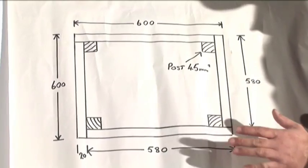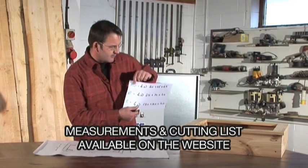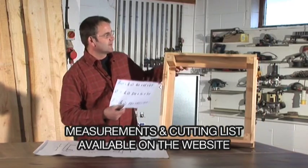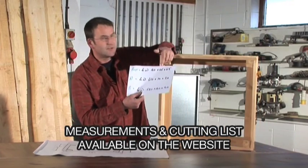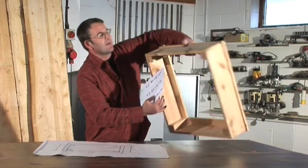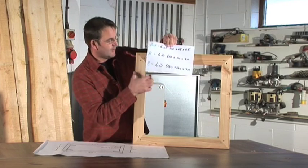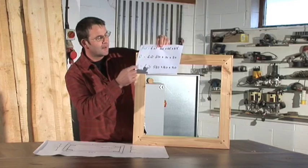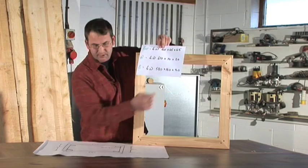We're going to put this information onto a cutting list. Effectively what I've got here is the posts - I've decided to write down the sizes of the posts, they're the height, so we've got 140 by 45 by 45. This A would be this piece here, the trim around the top, that is 610mm by 70mm wide by 20mm, and then we've got the four side bits, 580 by 140 by 20.